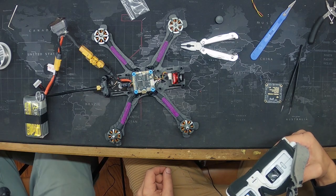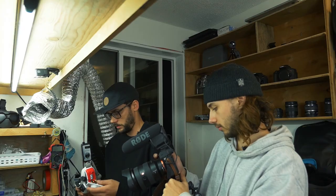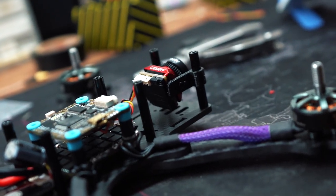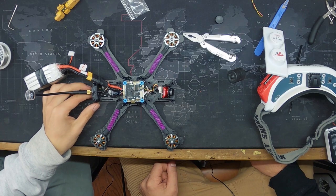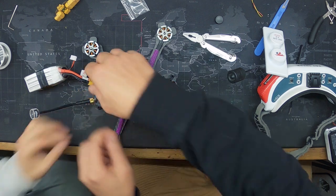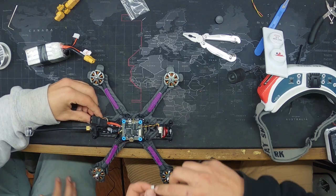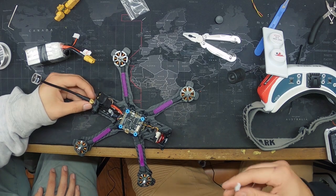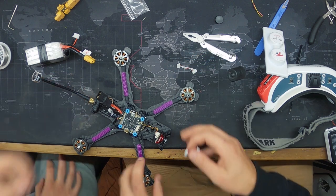I don't see any colors. I don't see any LEDs. Oh, that's why. We're using the smoke stopper. Right. Dude, did we get a dead VTX? Just worried that all of a sudden I looked and this black and red is saying current RX6, which doesn't make sense, might be crossed over. I hope we didn't just ruin our stack that way.